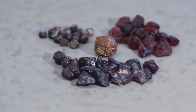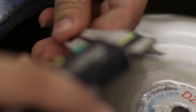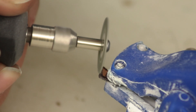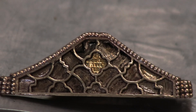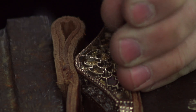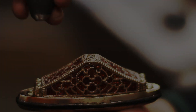For decoration of the pommel, Black Hills garnets found by the team, along with some from India, were selected. These garnets were ground to slabs and polished. Each garnet slab and a gold plated waffle foil was then cut to fit the cells of the pommel. Once the pieces were inserted, the bronze walls were peened using a punch and hammer. The pommel was secured, completing the sword.